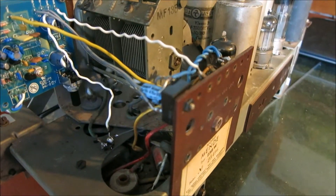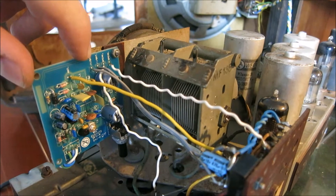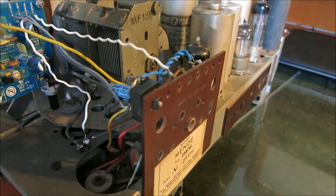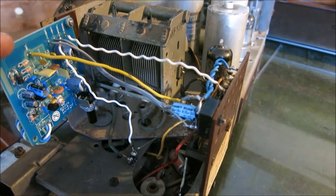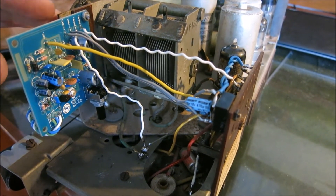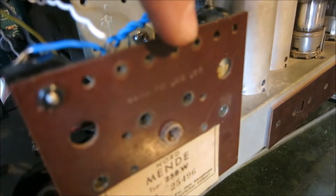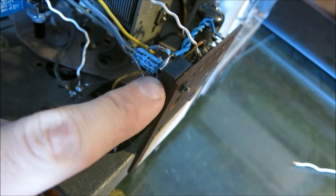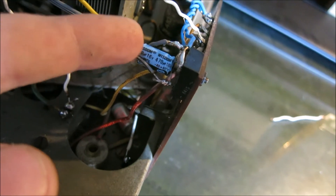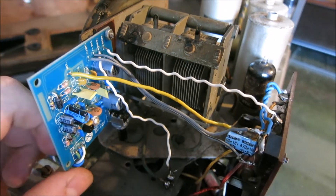Here's how the basic setup looks. The original thing is powered by a 9V battery over these two lugs. The transformer puts out 6.3V AC; if we rectify that, it multiplies by 1.4, which is around 8.5V — plenty enough, as there is a voltage regulator which steps the voltage down anyway. On here, the two wires marked with 'gelb' — German for yellow — carry 6.3V AC. That goes into a rectifier, gets rectified and filtered through a capacitor to smooth out the DC, and then gets fed right into the FM module.